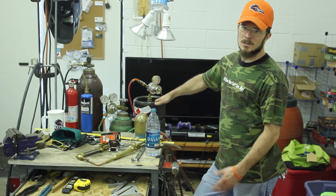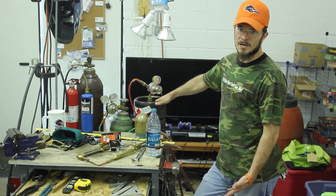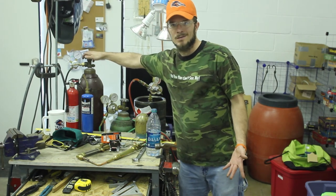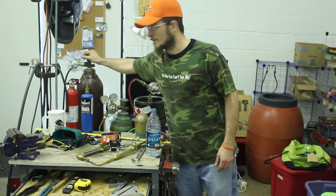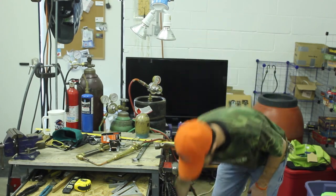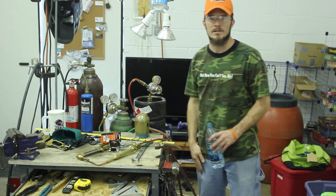The higher up it's turned, the more money I pay, but the cleaner my welds. And since I don't weld that much, this is a $35, $40 fill, whatever, I'll waste it. I want a good clean weld. And right now, since my regulator is busted, I don't even know what it's running at, so I just turn it up. But that's an inert gas. It's not a big deal. I don't play those kind of games with the oxygen at 7.